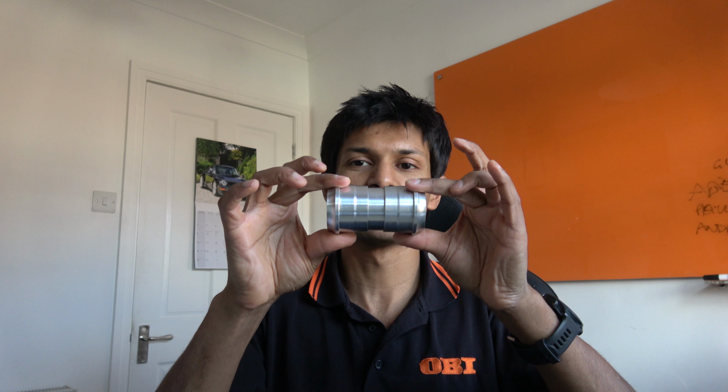The other thing associated with this is a stiffness advantage. When I made these things, I didn't make them this way to make them stiff so that people would feel the pedalling advantage of having a stiff bottom bracket. Obviously that is advantageous, but the real reason is that when you are under load, you will actually deflect your crank. The crank will bend ever so slightly, and that will place a load onto your bike frame. Bike frames are not that stiff. They're almost like jelly in comparison to the crank, which is significantly stiffer. If the crank's bending, you might induce a fatigue failure, but you will almost certainly cause accelerated wear, not necessarily premature wear, in the bearings. So having a stiff metal structure around will reduce that effect.